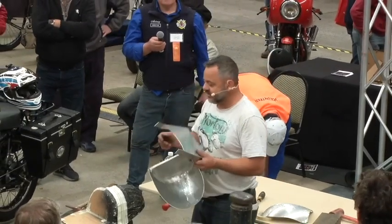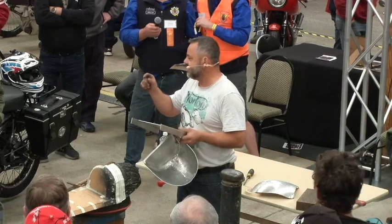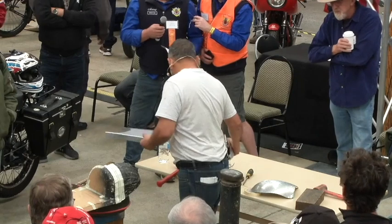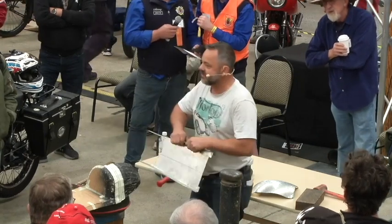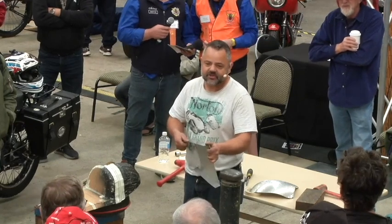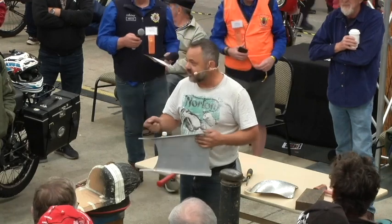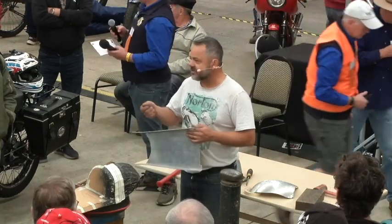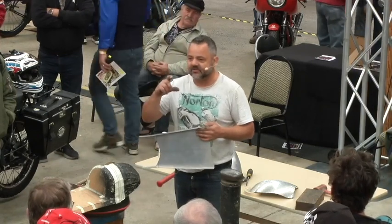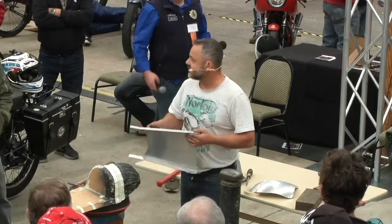When you first do the, you're talking about the annealing? Just basically neutral. But it's when you weld with an oxy on aluminium, the material has to be really, really clean. You have to use a stainless steel wire brush on it too. Don't use a steel brush to clean it up. And then you've got to use the right flux, and you can't see the material melting, so you've got blue lenses rather than the green lenses. And it's really hard. It's not easy. It's really hard to do.